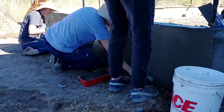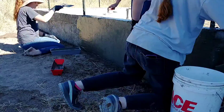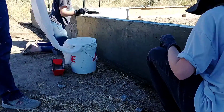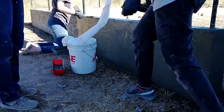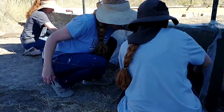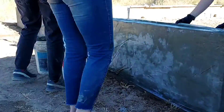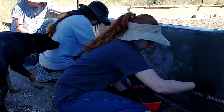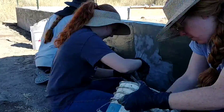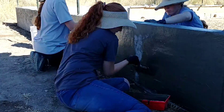The girls said it was like icing a big cake. After putting a thin layer on the wall, we applied some fabric left over from doing our leach field — it's like a thin landscape fabric. We soaked it in a bucket, then smoothed it down and coated it in plaster. The outside and top of the wall have the fabric, but we didn't put it on the inside of the wall. The plaster filled in the holes nicely and seemed to add a lot of strength and stability to the wall.